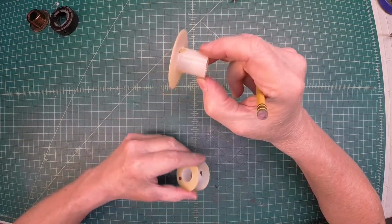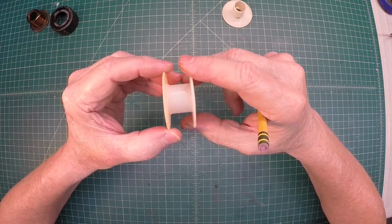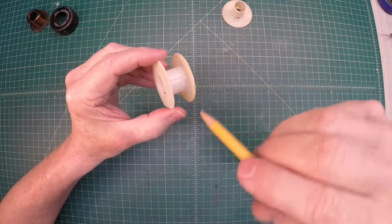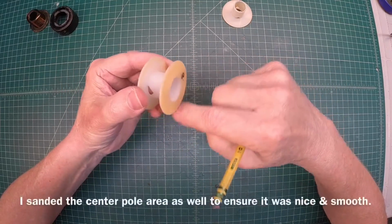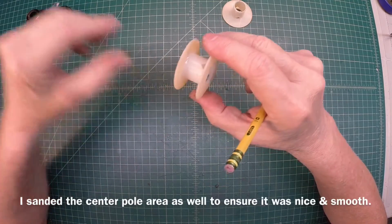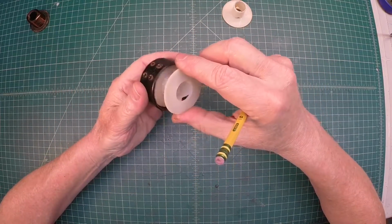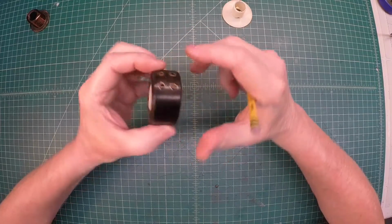So you can see I've got a flange over here missing, and here's my modified bobbin now to receive the new magnet wire. Some epoxy here on this end, everything sanded, filed, and the circumference of the bobbin to fit inside the form itself. I got a B for bottom representing to go here, and it just goes in as such.